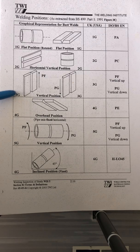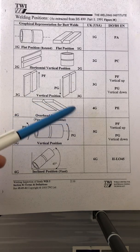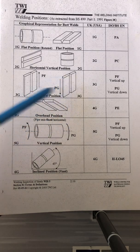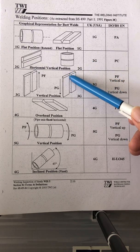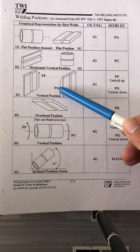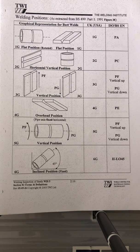For the vertical position, 3G — you start welding from the bottom going up. That's also called PF in ISO/BS. For welding downhill, you start from the top going down — that's called PG. And for 4G position, that is the overhead position.